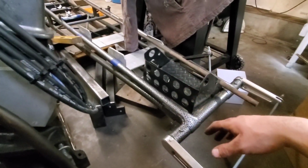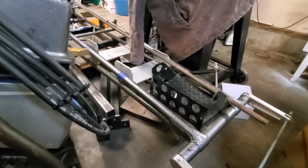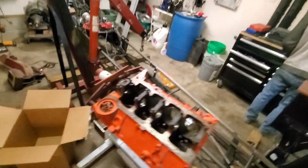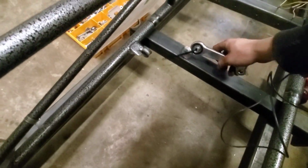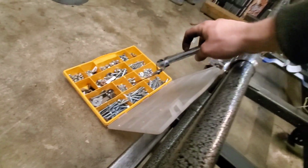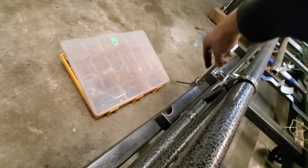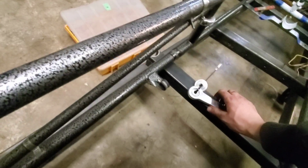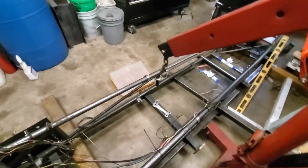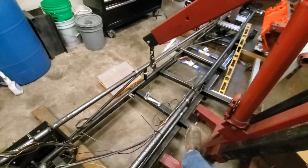We're waiting to get the fuel tank back now. Then we've got to send it off to not powder coat, anodized. We're just going to get it gloss black anodized. We ordered a steering arm that we paid a pretty penny for, too. We've got to get two. It'll sit right here, and obviously down a little bit further, and that'll be the push-pull steering, rather than friction, rather than having it aluminum on steel, or chromoly, I suppose, because that just doesn't work very well, and the steering does not feel very good.